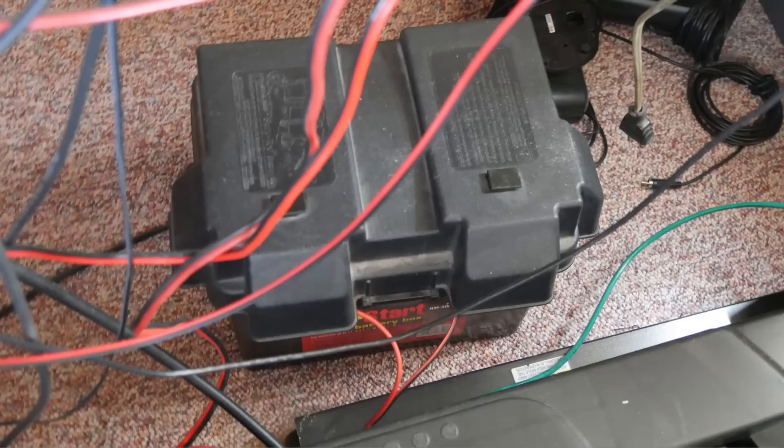This is the battery that actually runs the station. In solar terms, this is sometimes called a relay battery. It sits directly under the power distribution panel for my ham station with a very short cable. This battery is also charged from the main battery — there's just 12 gauge wire in between them, but that's enough that over time it will level out the voltage and level out the charge. The battery in here is a Walmart marine type battery. It has the same lead acid chemistry as my main batteries, so they can be connected directly in parallel. As this battery starts to go down, it will draw recharging current from the main battery. This has worked this way for years.